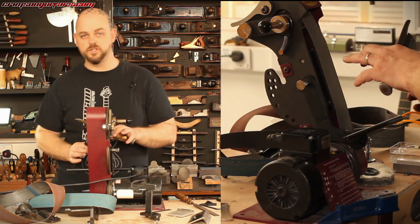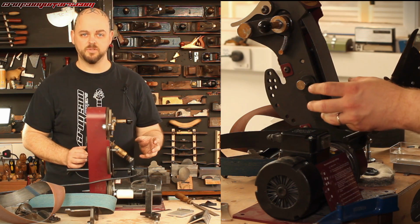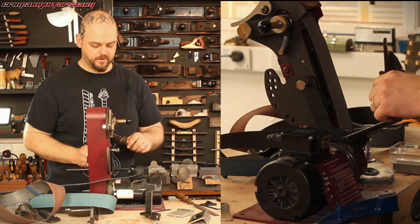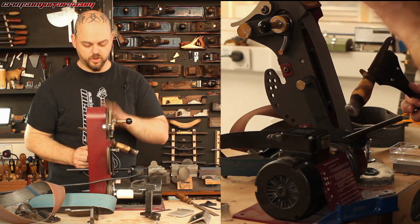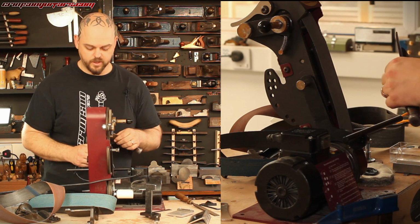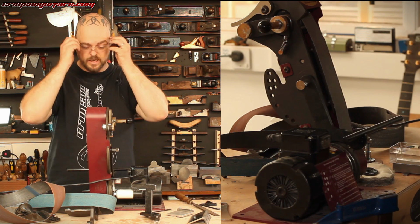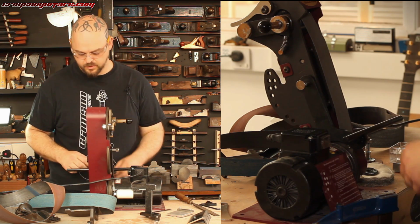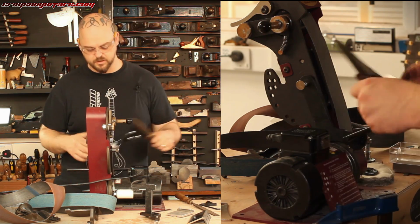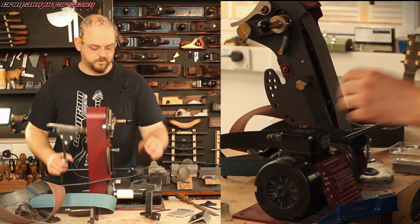The one thing is you don't want this to overheat. What I tend to do is have several things that I'm sharpening at the same time, so I can just put the tools down and let them cool down in between rounds. And I'm not going to go right through with this one because I don't have several tools all set up and ready to go. Now, especially when you're using grinders and linishers and, well, the health and safety police would say hammers and nails as well, but wear safety glasses. It is rather important. And, well, here we go.